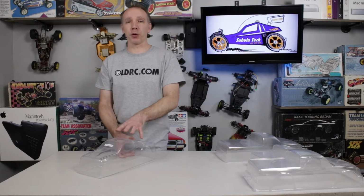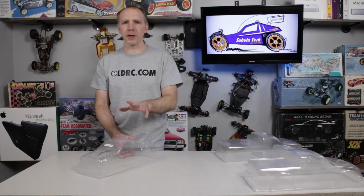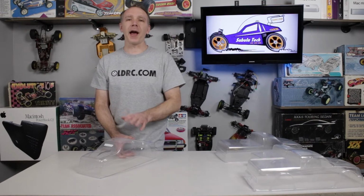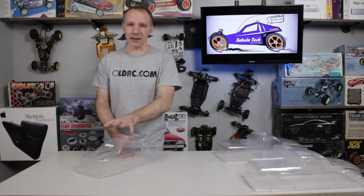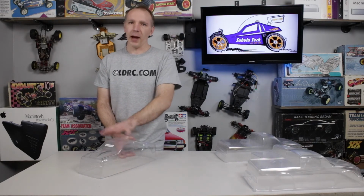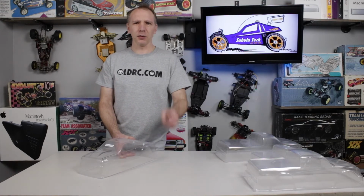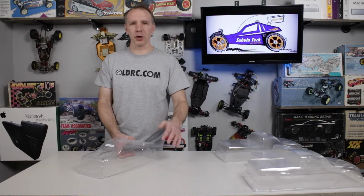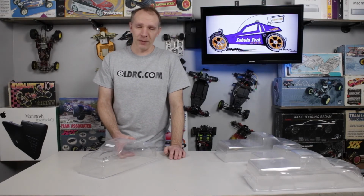And the masking was put the wrong way down on the mold after about the 5th body, and when that happens, because the mold's nice and hot and the plastic's all hot, that masking tends to stick to the mold, and then you have to clean up the mold and get all that plastic off. So we ran 4 of these, 2 bad ones and then 2 good ones that we'll have for sale first. And that's it. That's all we made on that run.